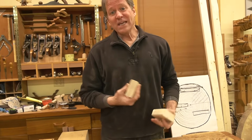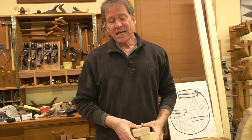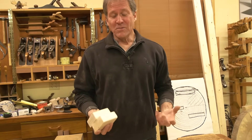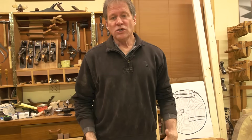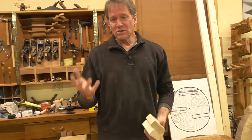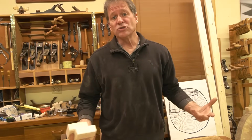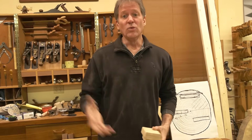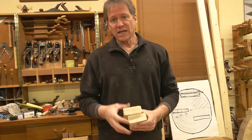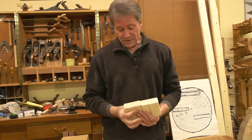When I was making a lot more 18th century furniture, we were always using genuine mahogany. It was so evident when you came up to a slow growth, dense piece of mahogany, you knew it by the weight. You would pick it up and go, whoa, this is some serious, dense, rich color usually. It was gorgeous stuff to work with. And then there was some that clearly was inferior. It just maybe grew too fast, almost like Luan. But for the most part, you could count on genuine mahogany being a beautiful texture and good grade. But it did vary tree to tree, so you had to look out even in that case.